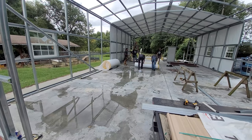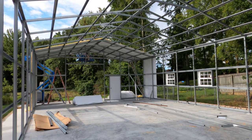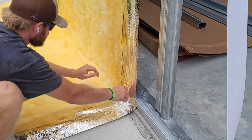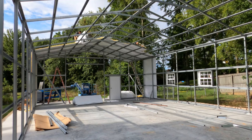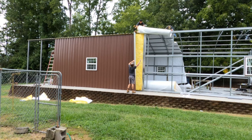This is where you're going to need your lift, plus a person on the ground on either side of the building. Get the insulation up onto the lift and up to the ridge of the roof. Make sure the tab of the insulation is facing the inside of the building so the next piece can go on top of it. Once you get it up there, slowly let it roll — don't just let it fall. This stuff is heavy and could rip the cover. Let it go nice and slowly until it reaches the roof line edge and drops down.